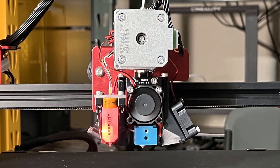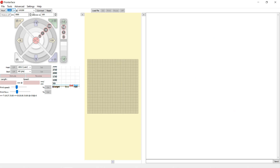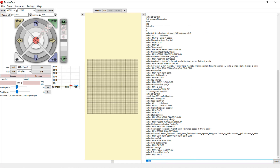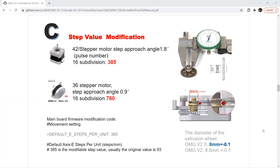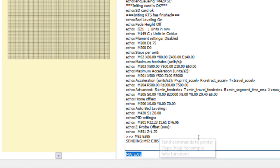The hardware installation is done. Since the gears of the new extruder are a 3-to-1 ratio, we need to set the new E-steps. But unlike the Ender 3 Classic LCD screen, the touchscreen of the CR10S Pro doesn't have the option to do that. In this case, we will connect the printer to the computer and use Pronterface to send a G-code command. According to the manual, if we use the NEMA 17 stock stepper motor, the E-step value should be 385. I will use Pronterface to send the M92 command and set it to 385, then send M500 to save it.